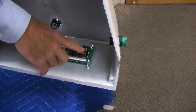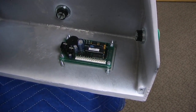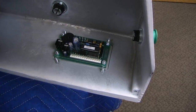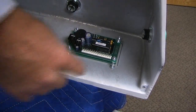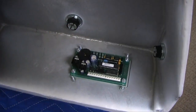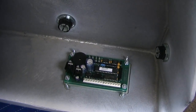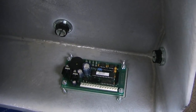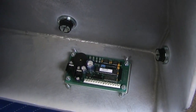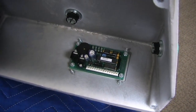There is the chip. The CMOS chip with all the software in it, we change this chip depending on the way the customer wants to run this controller, and we can actually modify the chip's data to make it function differently by pulling this off and putting another one on. It's this removable CMOS chip right here. Okay, you see there's four RTD connections. That same control is used for dual heat if we have a lower platen heated. Then you'll see four wires going to it, two to number one, which is the RTD on the platen, and number two, it says down in this area here, those two would go to a lower. So on the 1300s and 1100s, you'll see just one RTD set up to RTD1 on the controller. Any questions?